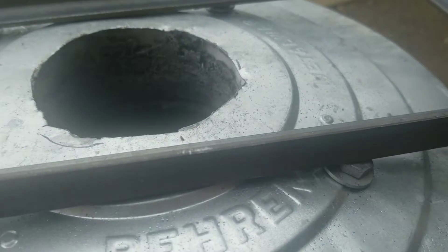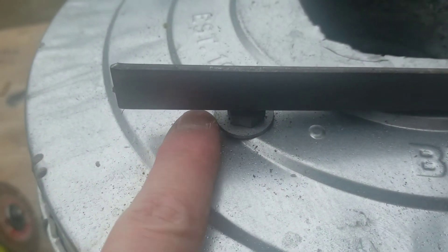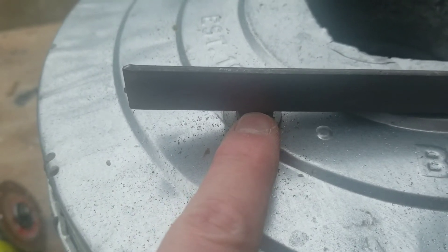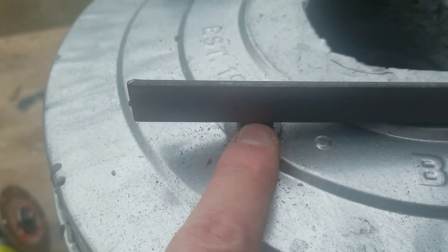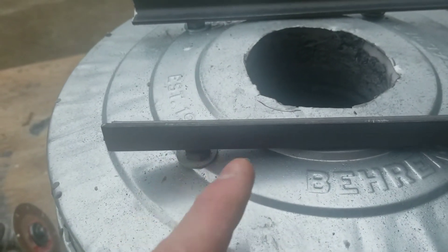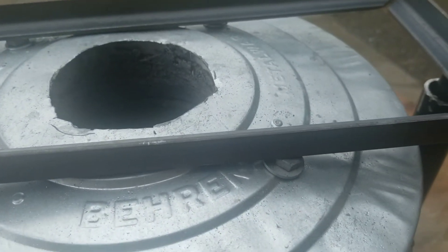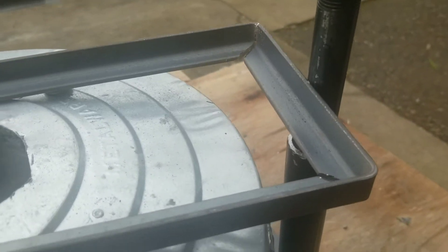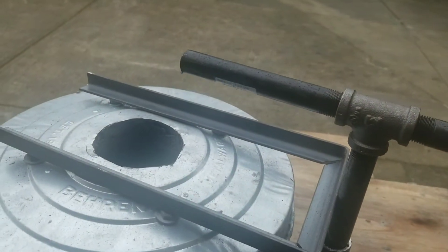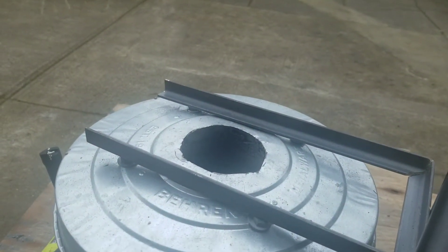It's going to have to be creative I guess. I'm going to grind off the top of these because I think they're galvanized, so you want to clean that stuff off. This is just mild steel so this should be fine. I'm going to clean it up a little bit to make the welds nicer, then just tack weld all these on. The idea is this will rotate off and go into a locked position to the side.